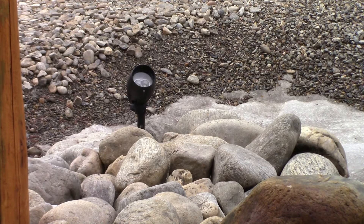I've made this light easy to remove because I've had these fail before. These are Hampton Bay things - you'd think they wouldn't be as bad as the cheap stuff you can get on eBay, but it's even worse it seems. There's a connector here. I pack it with grease so it doesn't corrode, but let's see if we've got voltage at the plug. We've got power coming out of the transformer - is there an open in the wiring? No, we're getting 13 volts here as well.